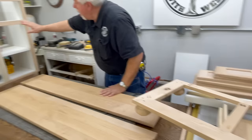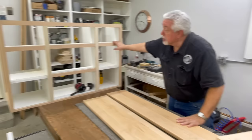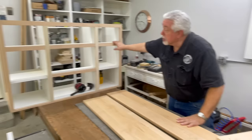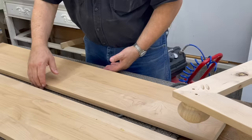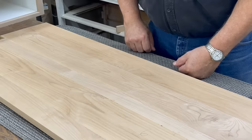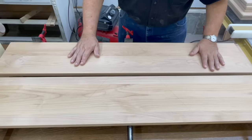We're moving along on our accent piece. We have our doors and drawer faces all built and sanded, we did our base piece with our bun feet, and our cabinet is all put together and sanded. Now we're going to be working on the top. I had cut out my pieces for the top and glued two halves together — five pieces total: three pieces here and two pieces here. I'm going to run those through my benchtop planer and once that's done we'll glue these two pieces together, leaving just one seam to sand out.